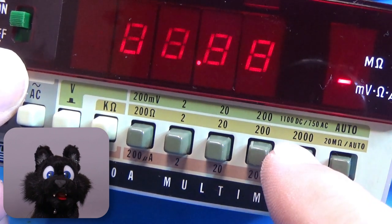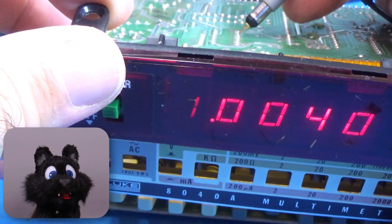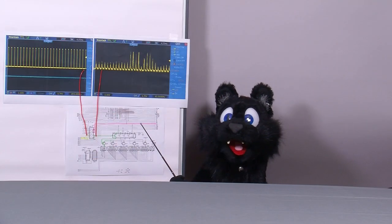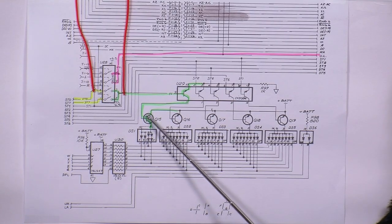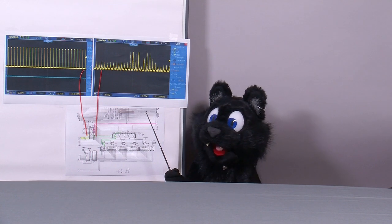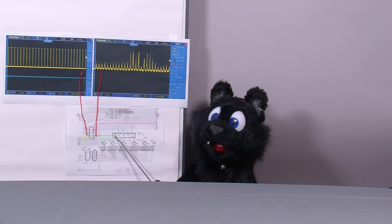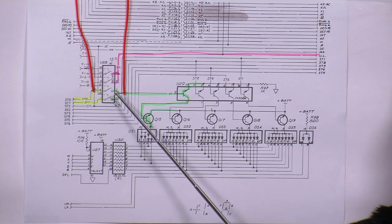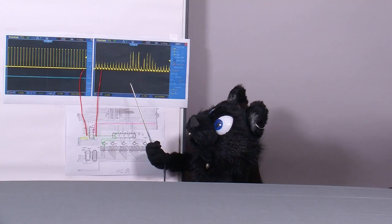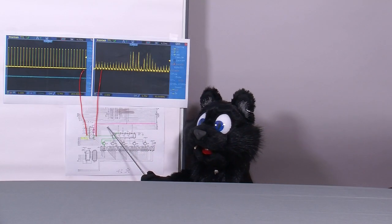But the auto range still was buzzing along. Also, the first digit — which is only a plus/minus indicator along with the leading 1 — was still acting like a lighting fixture in a dystopian sci-fi movie. After looking at the circuit diagram, I came to the conclusion that the driver transistor for that digit was sending the wrong signal. The input to that transistor was already not quite digital. Turns out the signal for the leading digit comes out of a 4016 CMOS switch IC. The inputs for that chip were showing nice rectangle signals, but the outputs were trippy. And the other half of that chip is related to the auto range selection. The plot thickens!